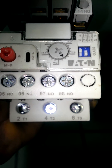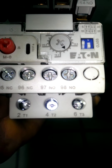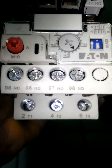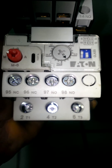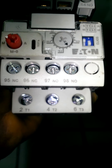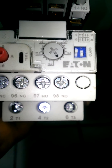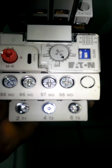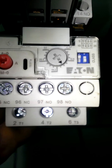So we called in the power company. They checked and realized that the power coming in wasn't good — it was an unbalanced phase — and they corrected the problem. It took us a while, but I said to myself, I benefit a lot from YouTube videos, so if somebody out there is having this problem, they need to know that if the phase is unbalanced, these solid state relays, which use CTs inside them, are very sensitive to a phase imbalance, and they will tell the device to open and shut down the motor.